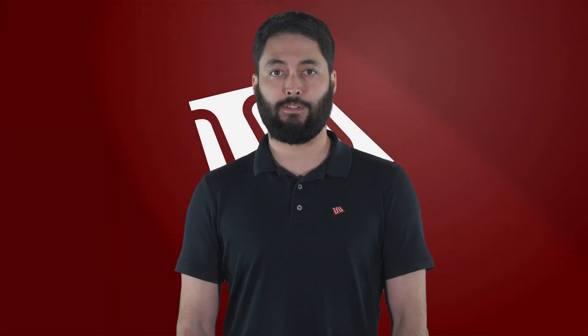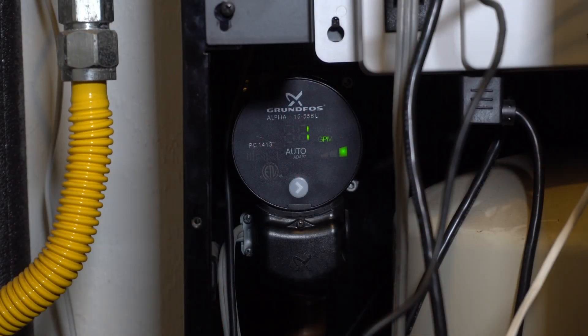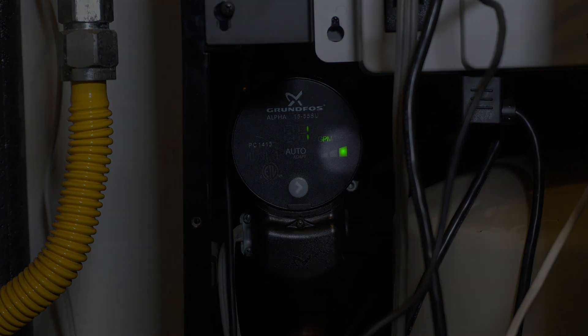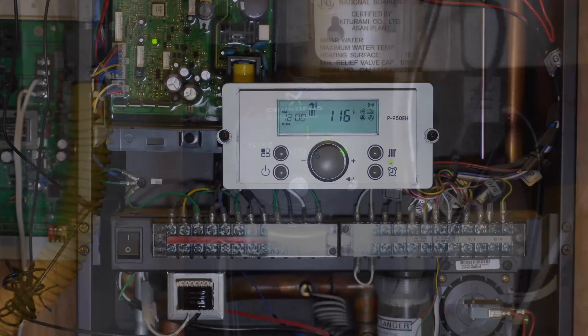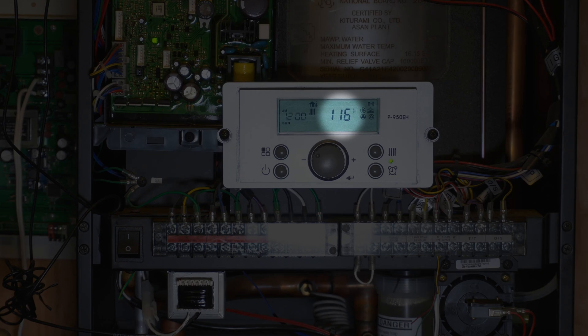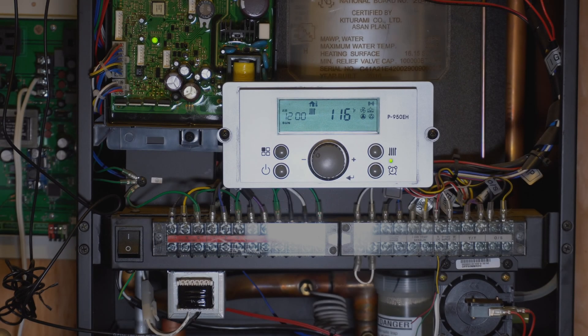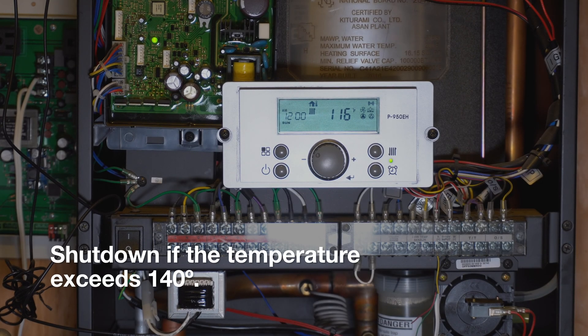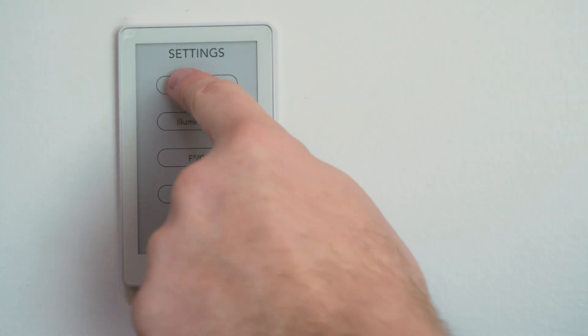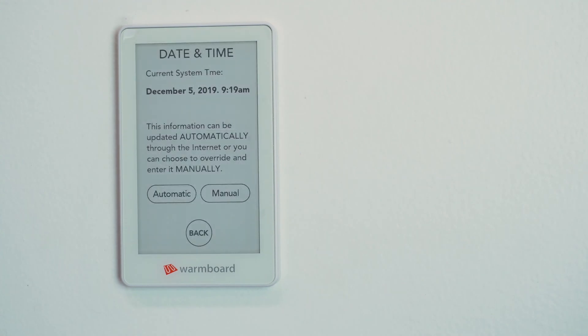Here are a few final items to be aware of. When water is circulating through the system, the LEDs on your pump will show the flow rate in GPMs. Confirm that the pump is set to the highest constant pressure setting. Make sure the water temps shown on the LED screen are between 90 and 140 degrees. If the boiler is firing at a higher temperature, shut down immediately and give us a call. Lastly, access the settings area in the thermostat to set the date and time throughout the system.